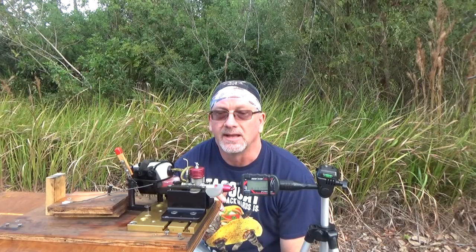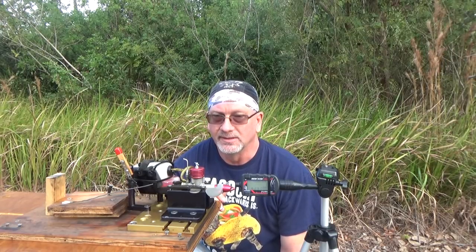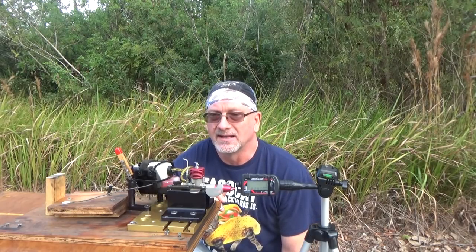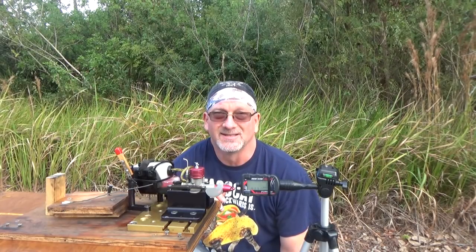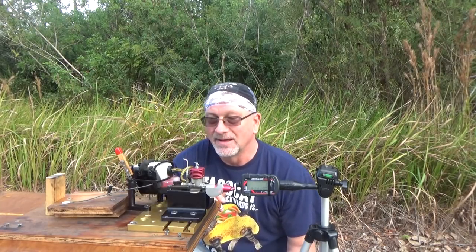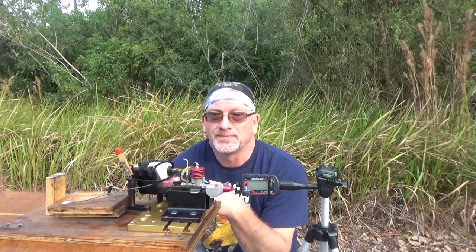It took a long time for me to get this started. I mean, a long time. A lot of hand flipping, which obviously I'm not showing in the video because it was pointless. Now, Brian Cox made it sound like he's never flooded a compression ignition engine in his life. Well, he may not have, but I think I did. Either that or I was just way off on the initial compression setting.